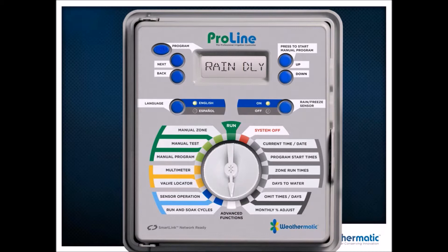Now we're in advanced functions and we're going to talk about rain delay. Rain delay is really about herbicide and pesticide applications — that guy goes out there and either turns off the controller and the landscape dies, or he forgets to turn it off and washes that $400 application down the road. I've got a contractor in Boston who changed all his controllers on all of his sites — if he signs a contract he changes the controller up front so they don't have to remember how to program different controllers. One of the features about ProLine is that once you buy ProLine, all the models program exactly the same. Rain delay makes sure that controller automatically comes back on and doesn't get left off. If you add SmartLink, you could do all that remotely and don't have to coordinate getting somebody out there with the herbicide guy.